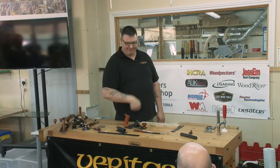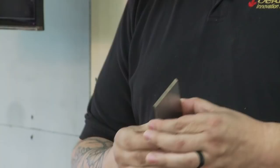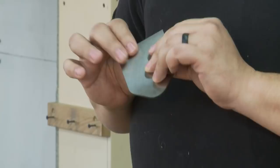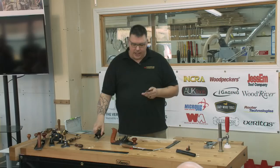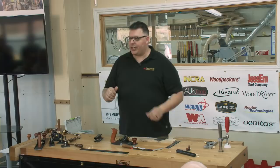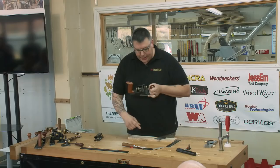I treat this blade differently depending on type. You can get a thinner blade or a more stout blade. I like the more stout blade because I treat it more like a plane blade — it has a 45-degree bevel on it. With the thinner blade you can also use it at the 45-degree setting, and it also acts more like a card scraper in that it can be bent using the screw at the back.